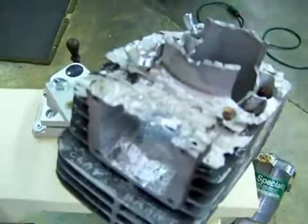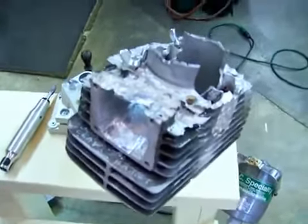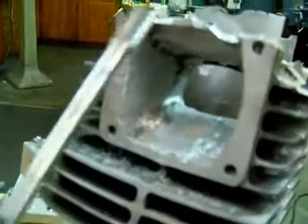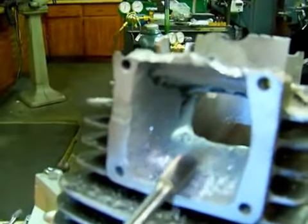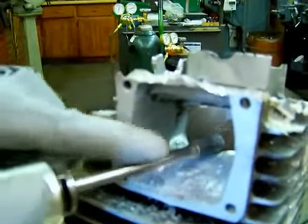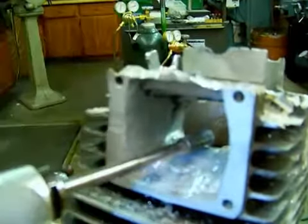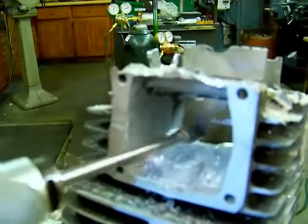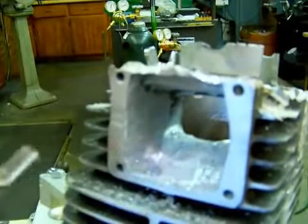It's seen better days. Another thing I want to go over here is using long carbide burrs, such as this one. Now, these are great if you can't reach in any other manner. When you're working like this right here, you can get a nice surface. But when you start to press back at the back end, you're putting pressure along that shank. That can start to bend that shank. That tip will come off center and start to helicopter. It can flop around in there. It can damage the tool, damage you, and damage the cylinder head. So try to work with the shortest shank that you can actually reach it with. It just works a little bit better.